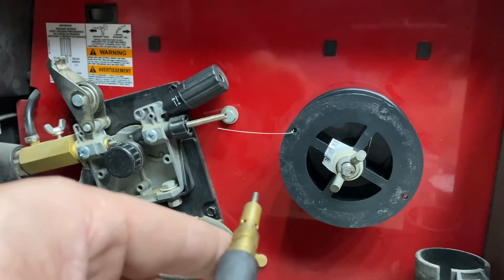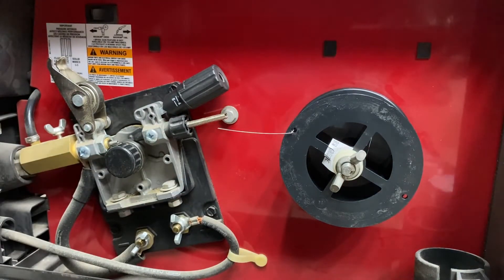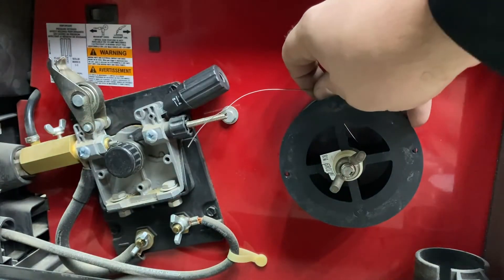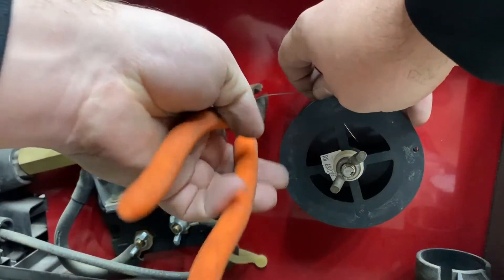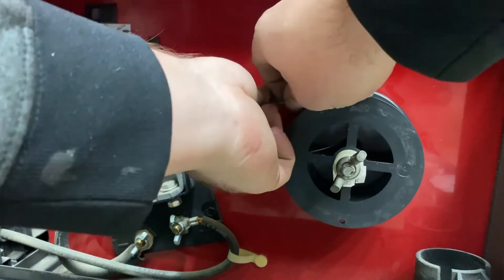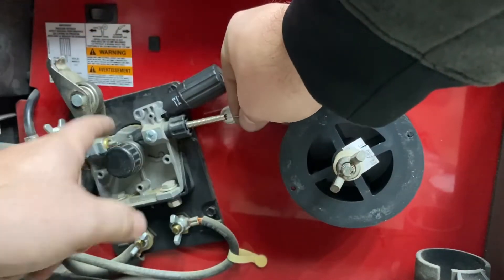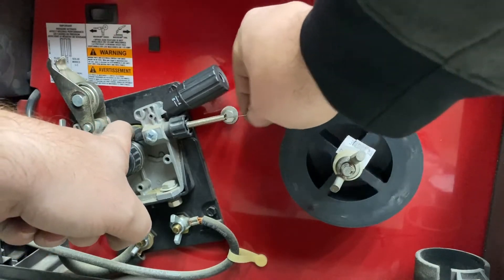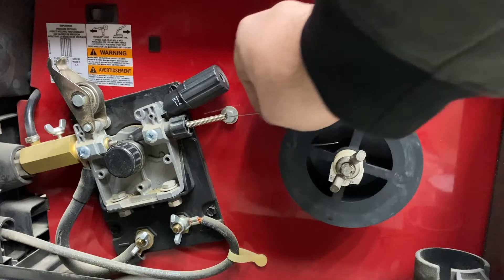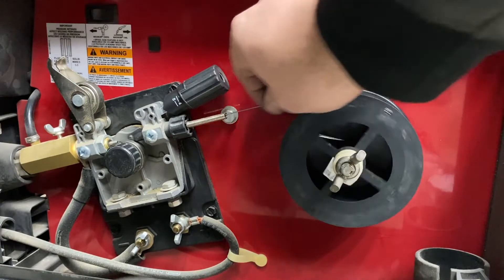As you can see I've also opened up the feeding mechanism by pushing this black knob back toward the spool. And now we're going to take the wire and push it through this feeding mechanism into the torch cord. I'm just going to go ahead and push it through that spring, line it up in the notch on this little wheel, and then into the nozzle on the feeding assembly. Just go ahead and push as much as you can through.